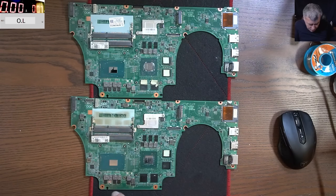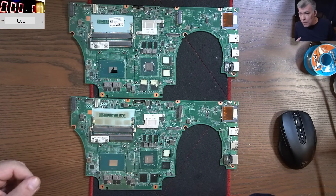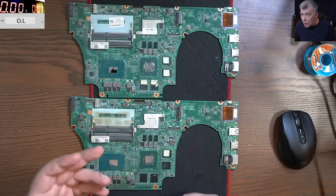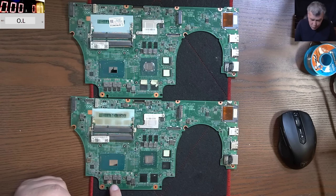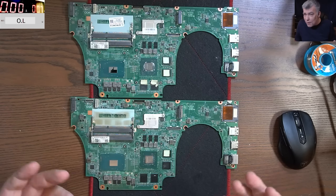How did this board die? Actually a MOSFET blew up. The MOSFET was not here, it was here — so I moved it. Because this processor has two v-cores. But this one is the primary one. The secondary one comes up when you use turbo, when the processor goes into turbo mode, that power rail comes up. So I swapped the MOSFET just to see if the driver is still good and if the processor will start working — but actually not.